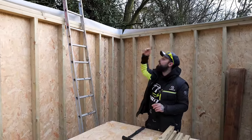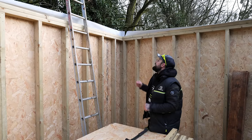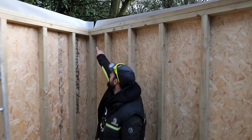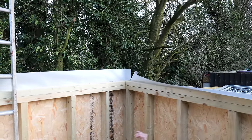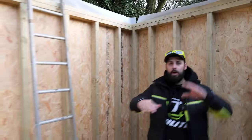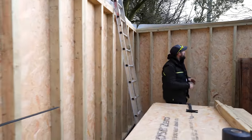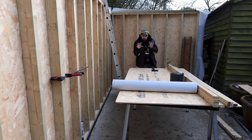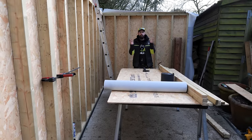We've then got our roofing felt all the way around these two walls. And then another thing we've done is we've lapped our wall plates. It looks like we haven't, but on top that's actually notched around and lapped. So that way we're tying the walls together with our wall plates. So now we're going to feather edge this one, which is the last of the awkward tight gap ones, and then we can start looking at the ones that are going to have gates in to get inside.